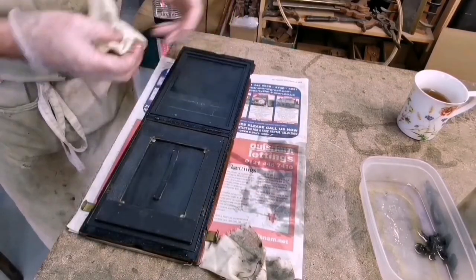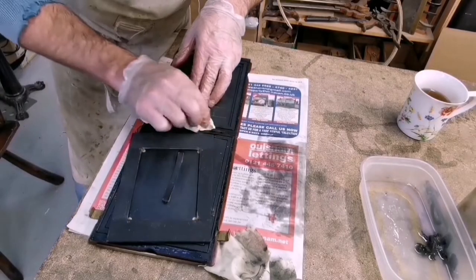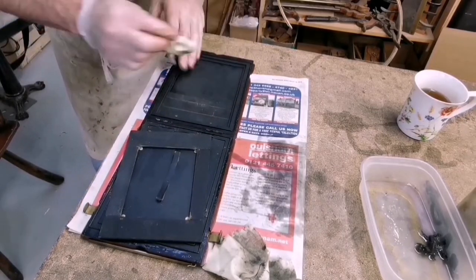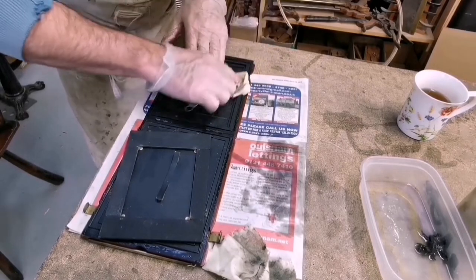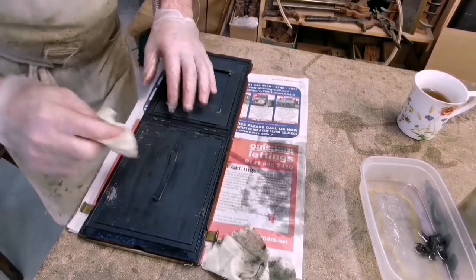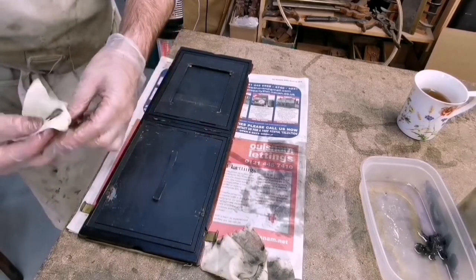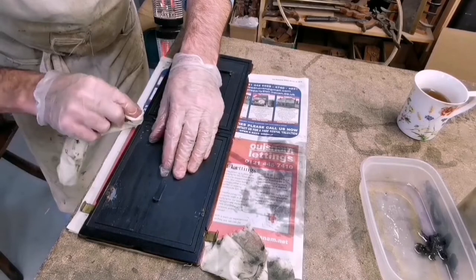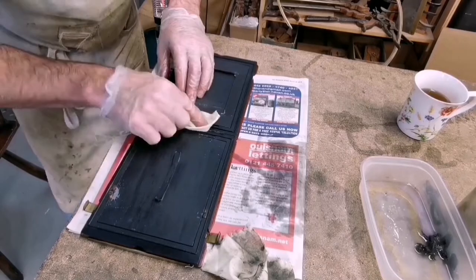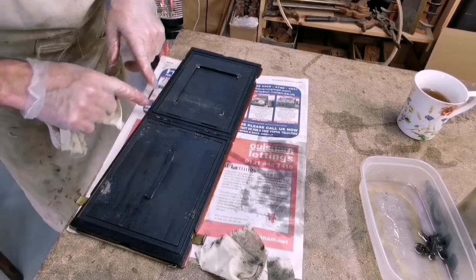And then open it, and you can see this wet rim all the way around. So I'll start in the hinge area and go up here, work my way around, turn in the cloth, that goes into there. All this is going to do is help seal this bit of wood, not seal it together, but just seal it and protect it a bit more. So I'm not worried about that. It's not got inside this little tiny moulding here.